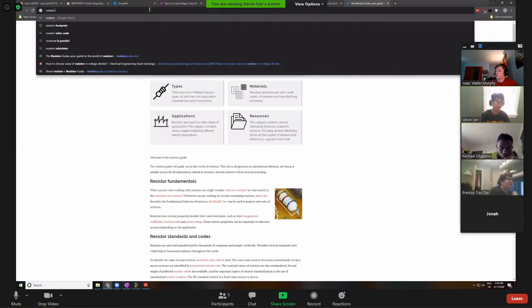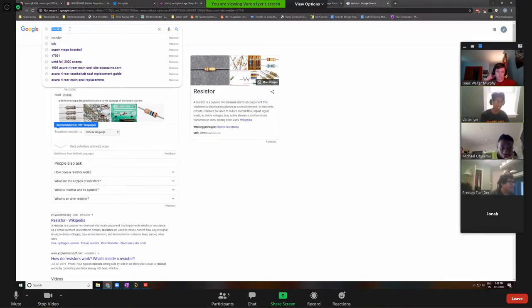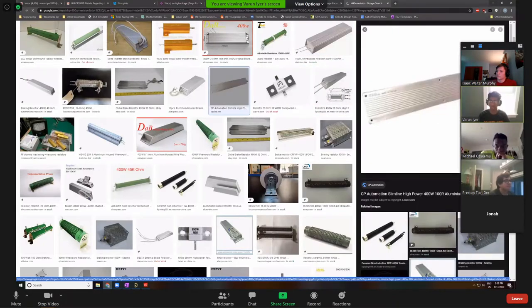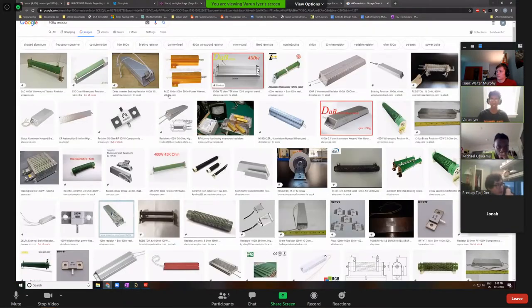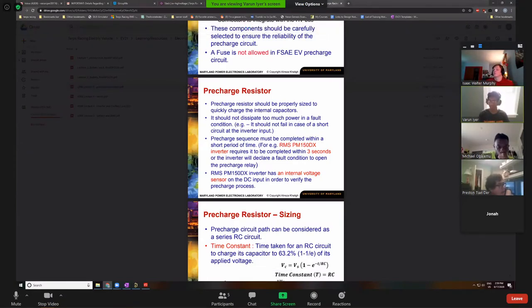So what do you get? Things that look like giant hunks of aluminum — they're called wire-wound resistors. The resistor is going to heat up a ton, so you want a lot of aluminum to dissipate all that heat. If you're ever looking for some sort of high-power load, you'll probably need one of these. The pre-charge sequence — time to go from zero to 400 — needs to be completed within three seconds, though there's a setting in the inverter that lets you bypass that.